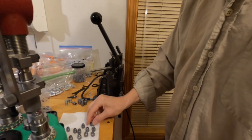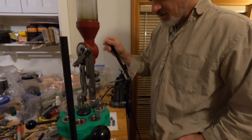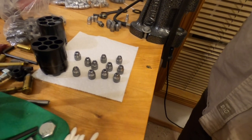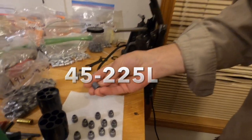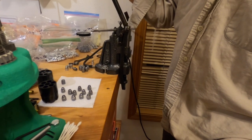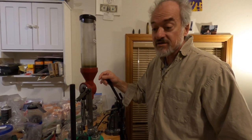Lee Precision makes a 200-grain mold for percussion revolvers that is heeled, and even that won't load into the Piettas without modifying. Likewise, with the Colt Walker I had to open up the loading window in the frame substantially to take these and others like the 45-200L — that won't load into a Walker without major grinding of the loading window. Other people have shown that in their YouTube videos, so I don't necessarily need to, but it is one of the things you'll want to do as part of the comprehensive process of shooting conicals in these guns.